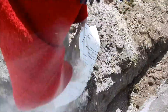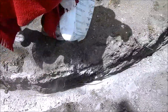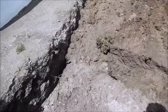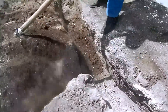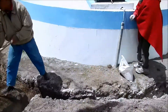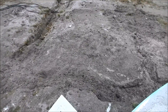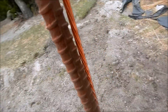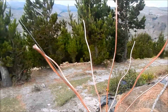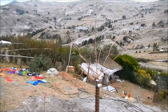What we're doing with this grounding cable is adding salt to the dirt to make it more conductive, and then after we add salt we're going to fill in the trench. The lightning protection system is now completed. The grounding lines have been buried with the salts. The final touch is our rebar-framed lightning rod. Copper lines come up and the stranded copper has been unspooled to form points for corona discharge to mitigate any future lightning strikes.